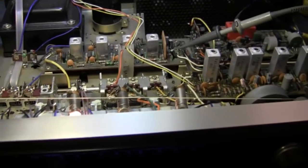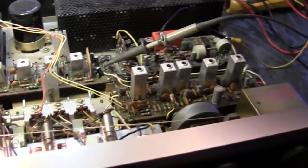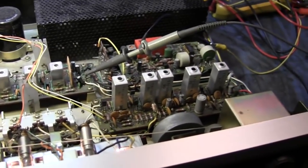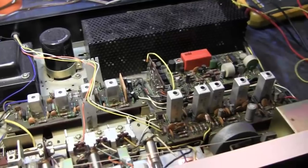That's the easy part. So this is all about troubleshooting and signal flow. You always want to follow the flow of the signal. Where are we losing it? Well, I check B+, front of the IF, the front end, and you can touch the audio output on the multiplex board. It hums, so we know we've got output. The output from there is good. So it's somewhere between the output of that IF and the input to the multiplex board.